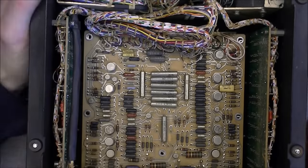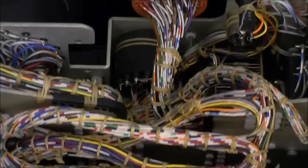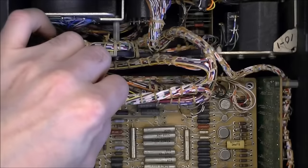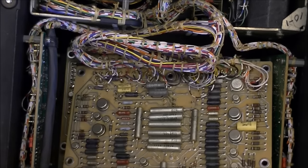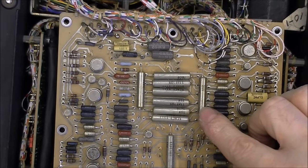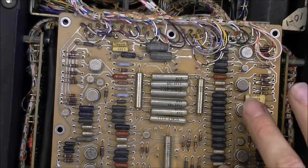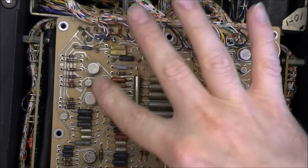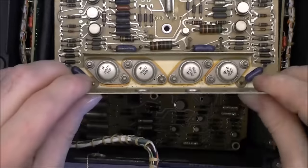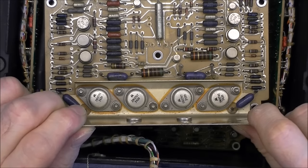Here is the sandwich of three PCBs. There is another thing at the bottom — round, probably a toroidal transformer. The sandwich of PCBs — you can see a very nice wire loom. The first PCB can lift off. We have this mil-grade capacitor — tantalum, maybe — 11µF at 10%, 15V. We have a bunch of precision resistors and some transistors — four power transistors, 2N3767, date code of 1974, made by Motorola.